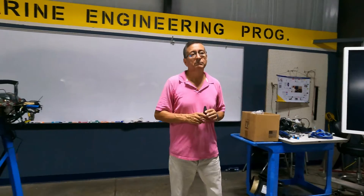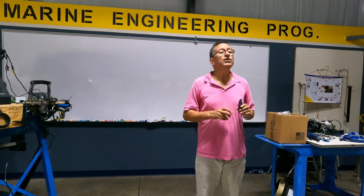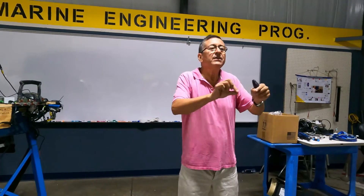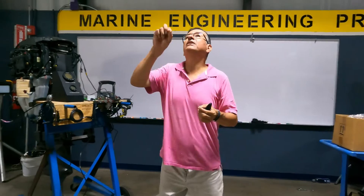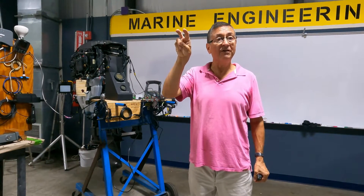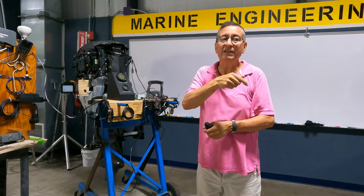Question: can I measure it from unplugging it from the back of the screen? You need to identify — you have a small boat. Where is the backbone? Where is the cable with the source of power for my backbone? Where is the positive going? The positive is going into that breaker. The breaker is off. I can measure right now, with the breaker off, the consumption of that equipment.